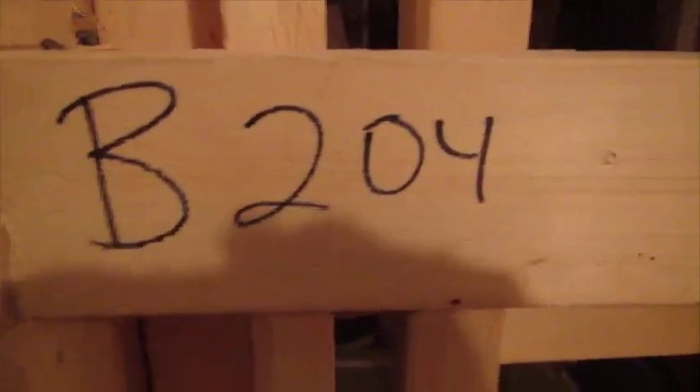This is room 204 on the second floor. We're going to look at the shear wall nailing. Sheathing at the end of the wall is also nailed at least four-inch centers all the way down.